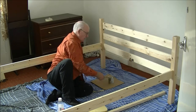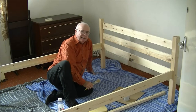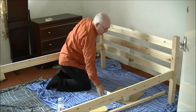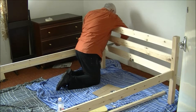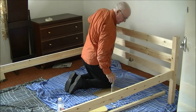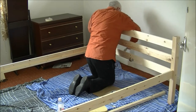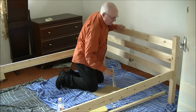Now, that being done, the headboard — same thing applies. I will now varnish it starting from outside and starting low down. So this is how we would go about it. Remember, I can lean that against this because it's not been varnished yet. So I do the lower one first, all the way along. Remember to take some varnish off the brush. Just a slight touch here to do underneath.